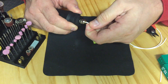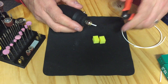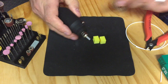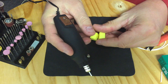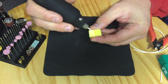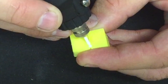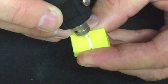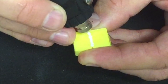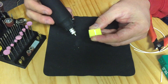I want to keep about a half an inch sticking out. Sometimes even that's too long, so you just turn it on, see how it looks — if it's flipping around too much, just clip a little bit off until when it spins it's almost spinning straight. Then you take your two pieces of plastic, get them where you want them — you can easily do this in a clamp — and push the filament while it's spinning right into the two plastics. The filament starts to melt but the plastic on the two pieces also melts, so the white melts with the yellow. I'm using white so you can see the difference, but normally you'd use the same color as the plastic you're welding.